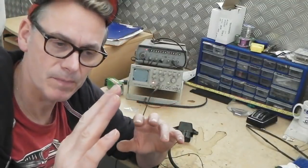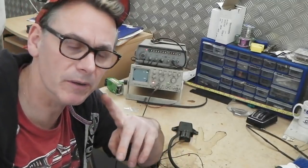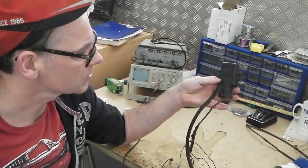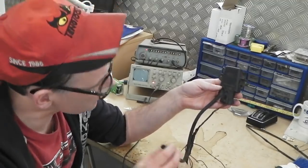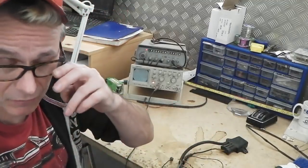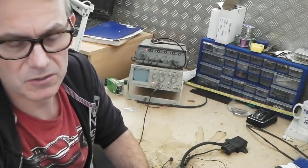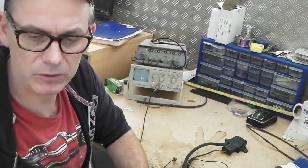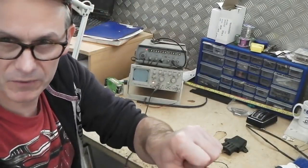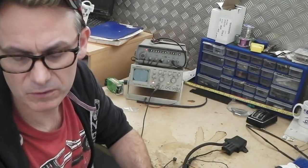So we do need to have a disengagement upon engine load, and that's where the vac switch will come in. Yes, could have done it electronically, but it's overkill really, it's overcomplicating things by adding a switch box to this. Could just build one up, but I'm not going to know the range. It's easier just to get an adjustable vac switch off the shelf, already done, tried and tested technology, bolt it on, 2 wires, so we just need to add an extra 2 interrupt cables into that loom. Good job that we've not wrapped it yet, to include the option for that switch, and perhaps route the cables down into that loom now while we've got the chance. Okay, it'll have a separate multi-plug, but that doesn't matter. 2 plugs on the gearbox ain't much difference than one.